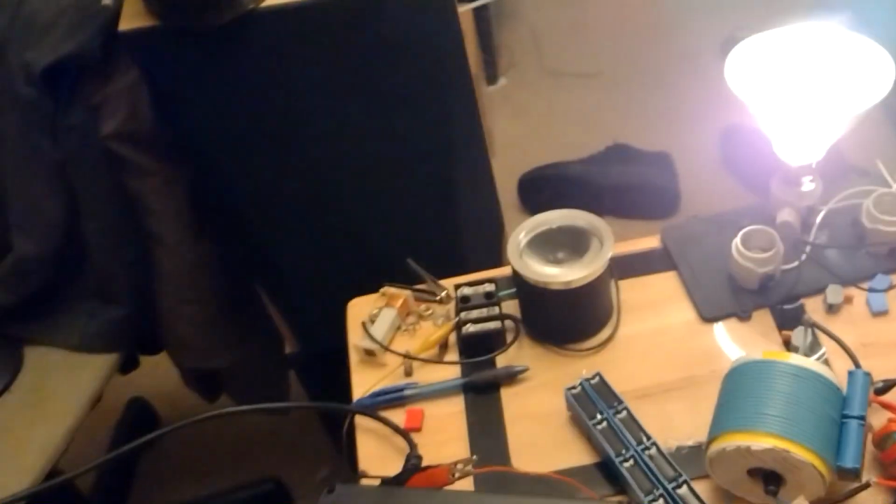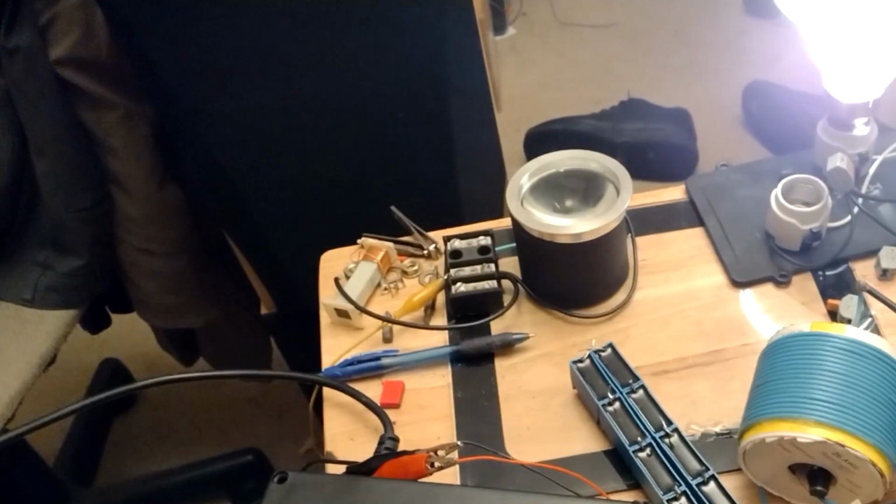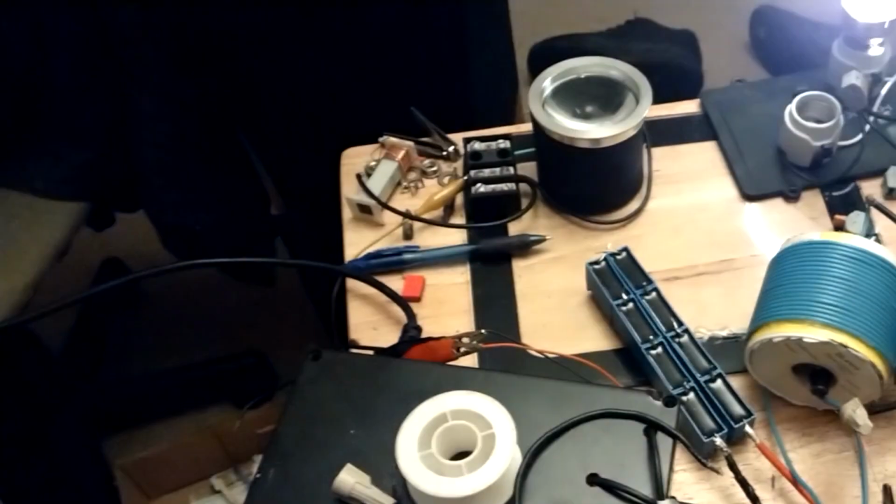so what's interesting to me about that is not only the OCD not wanting to kick in, so it's transferring power pretty good, but the inverter seems to run that no problem, whereas it's normally kind of difficult to get that all the way up without it struggling, wanting to cut out. I can get it to cut out if I cut up enough. If I cut up both the on time and the duty, then really start cranking that thing.